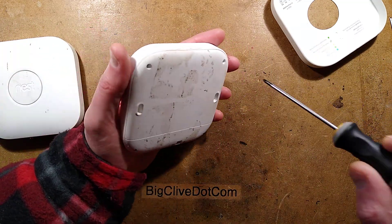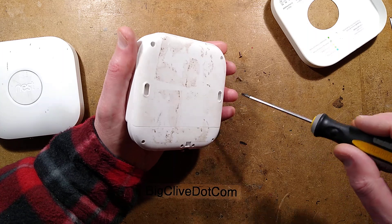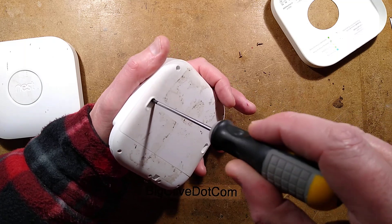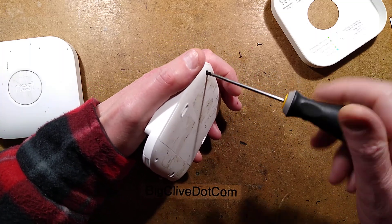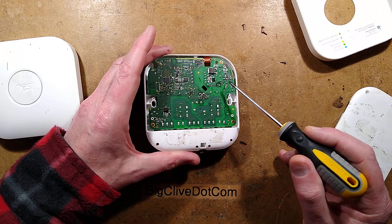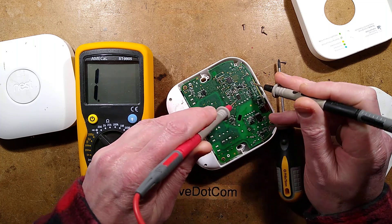Let's pop the back off and open it up to see if it's exactly the same fault. If there's a suspicion it is that diode, I'll pop that out and see if it clears. Finding a replacement turned out to be quite tricky — none of my usual proper electronic suppliers had that exact diode. Here's the mains power supply section — there is the suspect diode. I get the feeling this is going to be short circuit. Continuity on — yeah, I reckon that diode's screwed.